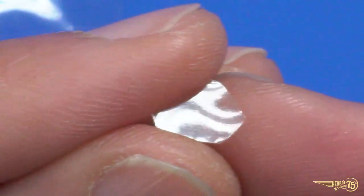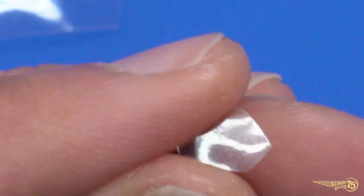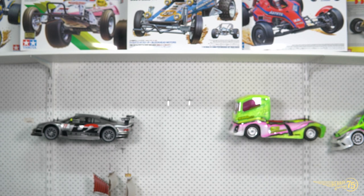the edges, and that's quite easily done by sanding. So even though it's so soft, you'll be able to see how easily it sands into shape. So let's go get sanding blocks. Okay, so I've got a couple of sanding blocks here. So we've got 400 and 240, and we've got the really fine ones there as well. So if you're doing the basic shaping, we'll use 400. 240 is a bit on the agricultural side.